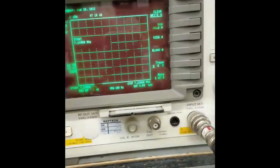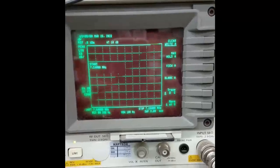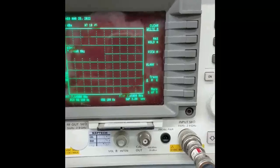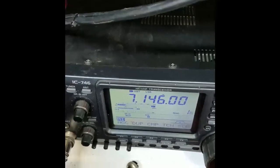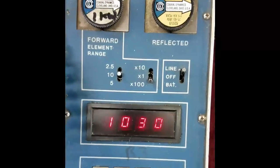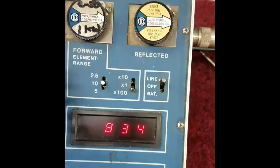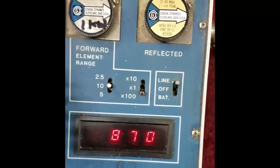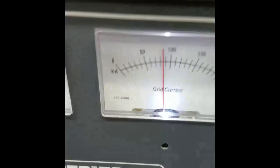The other thing I'm going to do is set the spectrum analyzer up on maximum hold for A, and then we're going to do a sweep of the spectrum from 7140 to 7150. I've got a microphone hooked up and I'm talking on single sideband — 1, 2, 3, 4, 5, 4, 3, 2, 1 — and the peak envelope power is reaching about 1000 watts or so. So occasional peaks up around 1000 watts, and the grid current is staying within range.